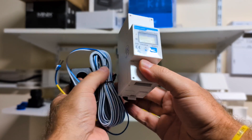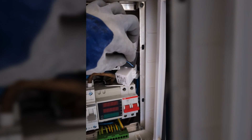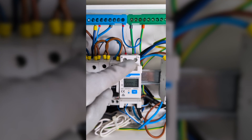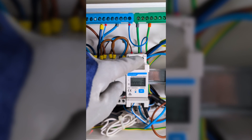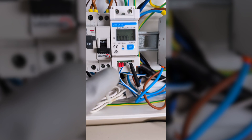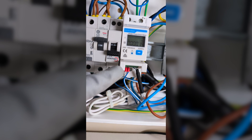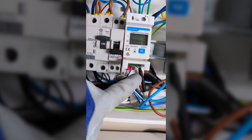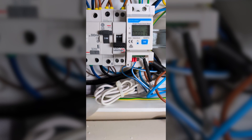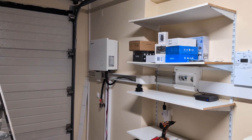Next I installed the smart meter that comes with it. The current clamp went to the main panel, which already has so many clamps I think there's no room left for any other, and the meter itself went to the secondary panel which is just at the back. The connection is simple: on top I connected the phase and neutral inputs, and at the bottom two wires labeled CT that connect to the clamp in the panel, and two that connect to the RS485 communication wires that will go into the inverter.